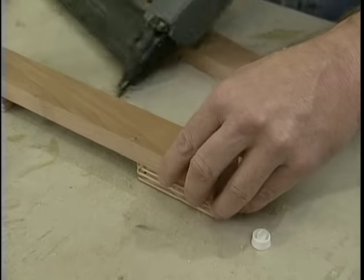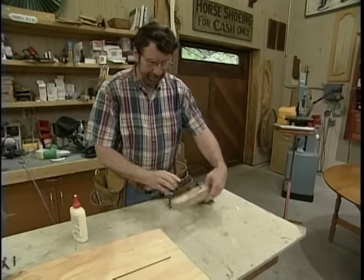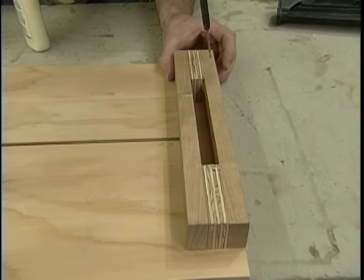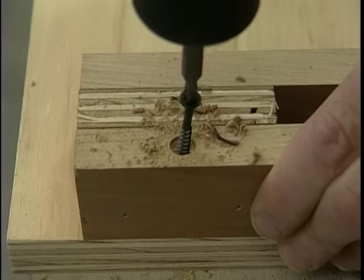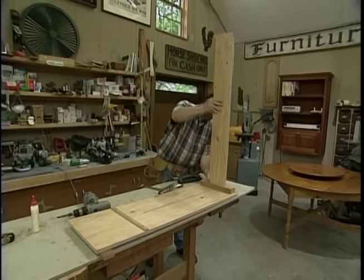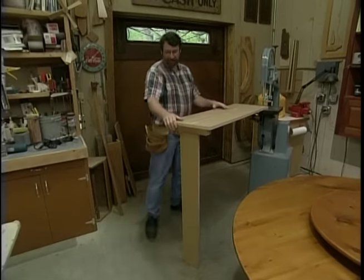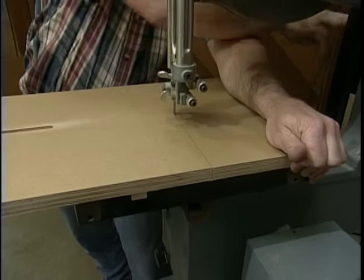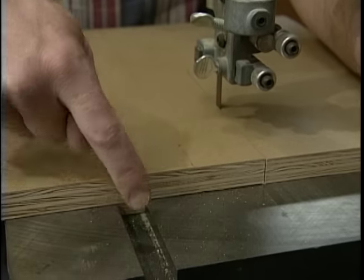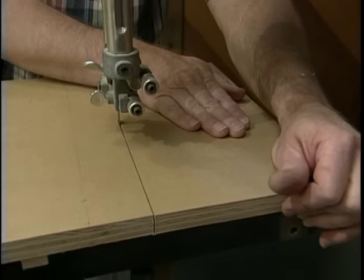Now I'm just going to take a couple of little blocks of plywood and these pieces of hardwood and create a little pocket into which I'll be able to put a leg. I'm going to position it right on the end of the jig and attach it with a few screws. The way this works is that a piece of six-inch, three-quarter inch plywood fits in that pocket and then I have a leg. I may not need the leg for every single tabletop, but for large heavy ones it's going to come in handy. Now I've made a cut in the jig — I simply placed that hardwood strip in the miter gauge slot and made a pass through the saw, and that gives me a piece of material out here which will support the waste material as I cut tabletops.